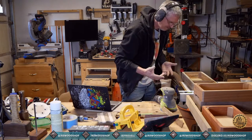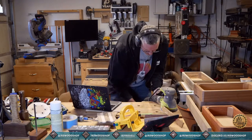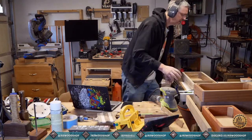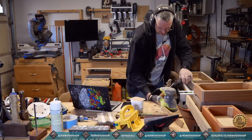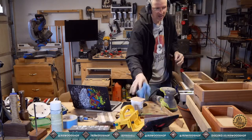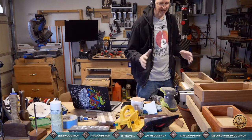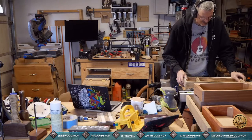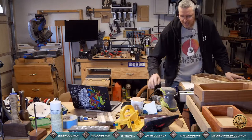And then it'll be ready for some 320 sanding. And then I can do the first coat of the aqua coat to fill the grain. So, you know, that's the process. Now, all of these other ones are going to get the same sanding process, but they're not going to get the grain sealer. That's why I want to go ahead and do this one first, because it needs that grain filler. All right, you go ahead and get this on and...